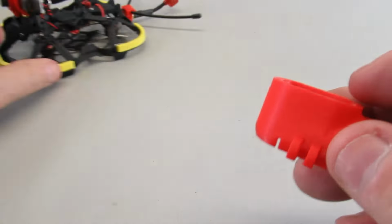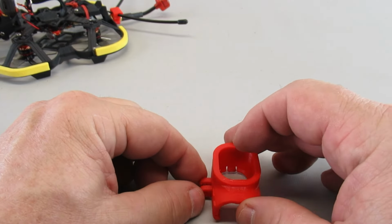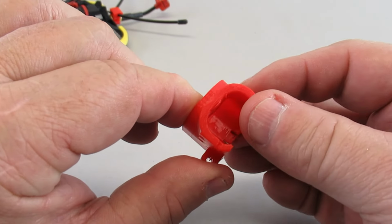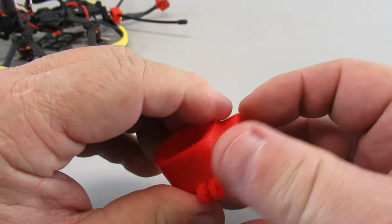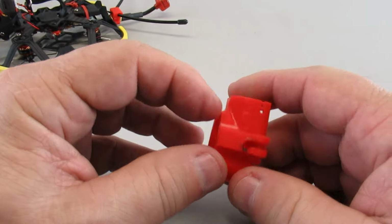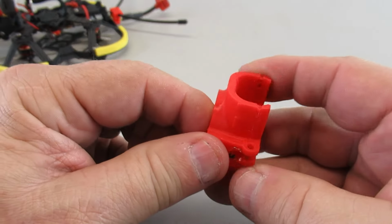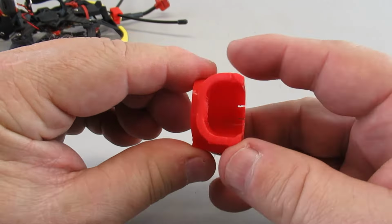The original mount that I made for it, I had this in the back, so basically it would be easy to print on the 3D printer. Wouldn't have to have supports. And it turns out that this actually has a little bit too much flex to it, I thought. So I abandoned this one. I basically just added a stiffener block of TPU as a test, put it back on there, and it definitely helped it. So it's saying that you needed something to be a little more sturdy.